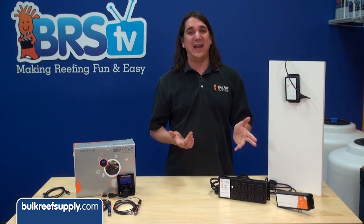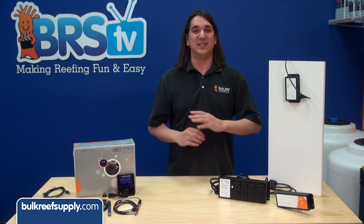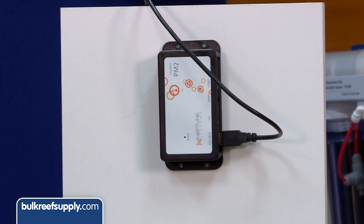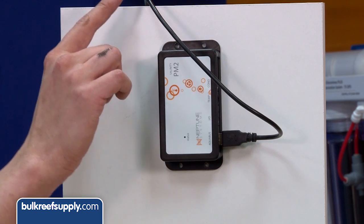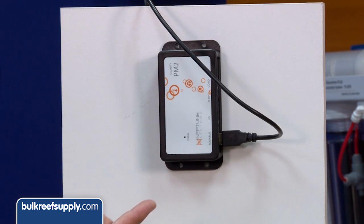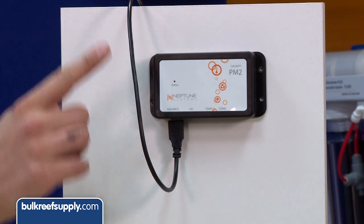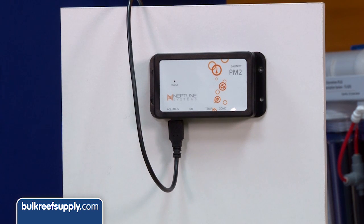It is all about drips, wet hands, moisture buildup, and leaks. Splashes can send water running down the cord. Upside down or turned to the side, it is very easy for water to run directly down the cord and into the connector. If you mount it horizontally, it makes it very difficult for water to travel down the cord and back up into the connections.